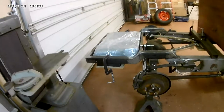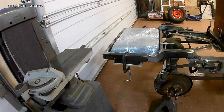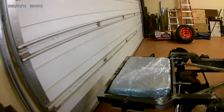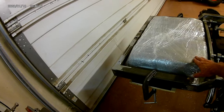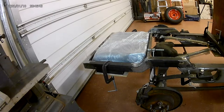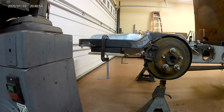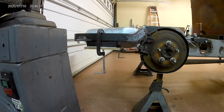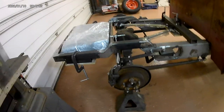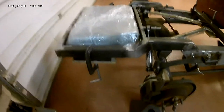I've got the fuel tank set in where it's going to be. I think I'm going to drop it about a quarter to a half an inch because it's got a little raise on both sides, and it's going to be real close to the dead cross member. There's plenty of room — it doesn't stick down very far at all right now — so I can drop it another half inch or so without hurting anything.